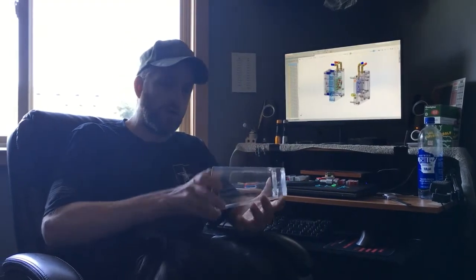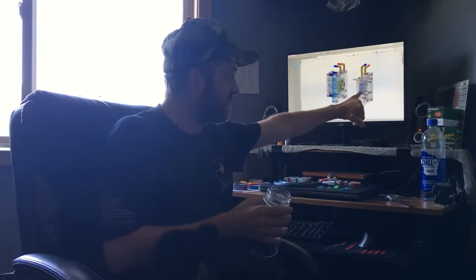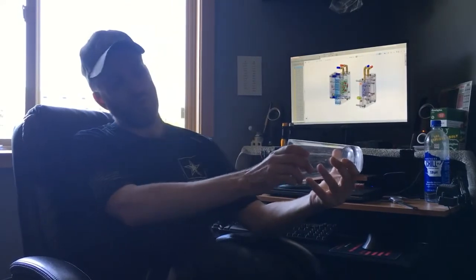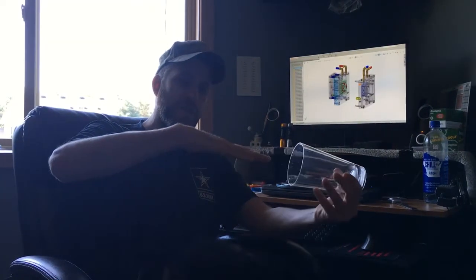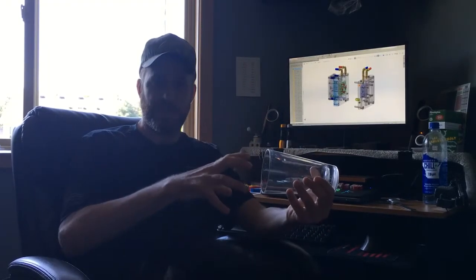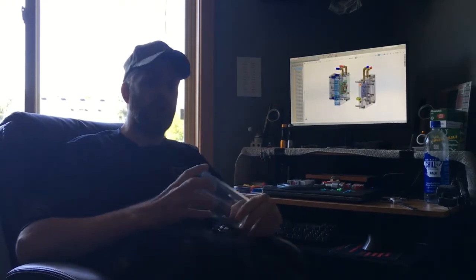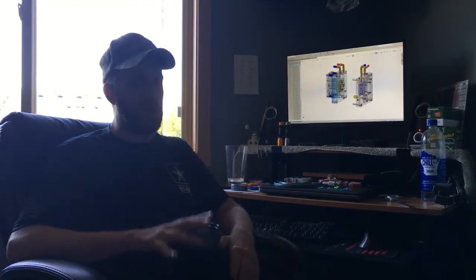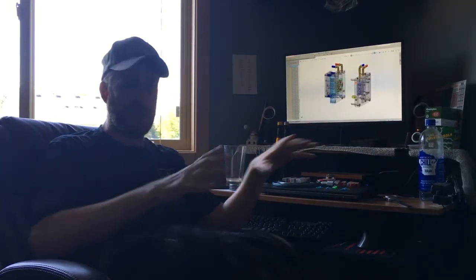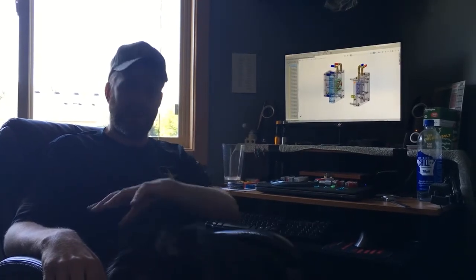Talking about draft angle — this is a draft angle, all the way around this cup of mine. The plastic is injected from the non-moving A side, and when the tool opens it pulls the part across with it then pushes it off. That draft angle, as soon as it starts coming off, separates the part from the steel that is molding it. Draft angle in many cases is a must. However, if you have an internal feature where the plastic is shrinking away from the steel, that doesn't always need draft. So there are different features that need draft and some that do not — you need to make sure you have draft where you need it and remove it where it's not desired.